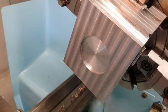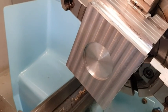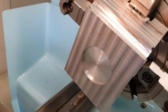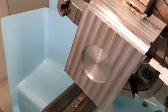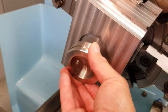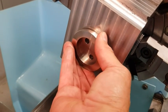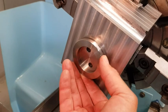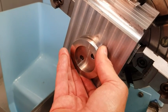The hole is finished — it came out at exactly four millimeters deep. The diameter I overshot a little bit, by maybe eight hundredths of a millimeter, about three thousandths of an inch. But this piece needs to be faced on the back anyway, which is why it rocks a little bit.